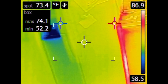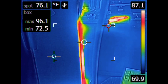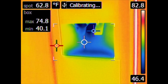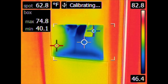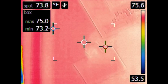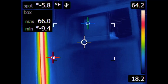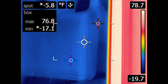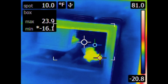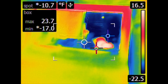You can also see some heat on the side. The imager will always recalibrate, so the blues and reds are always changing - you have to pay attention to that. When I open the door, the dark blue on the right goes from 47 down to negative 20, and it's the same color. So you can't rely on the color alone; you have to look at the actual temperatures. You can see it going down to negative 16, negative 17 on the back wall.